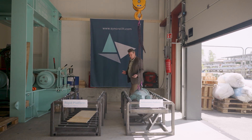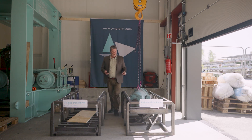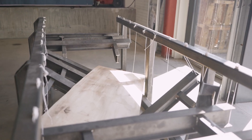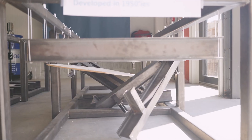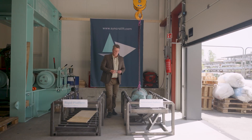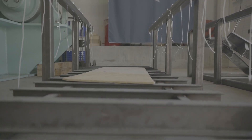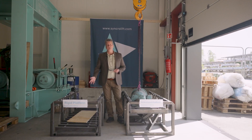So here you can see: after four wire ropes, you had a full collapse. After two wire ropes, you had a loss of bearing capacity on the platform. In other words, welding the platform stiff will help you in all the cases where you have a wire rope breaking.